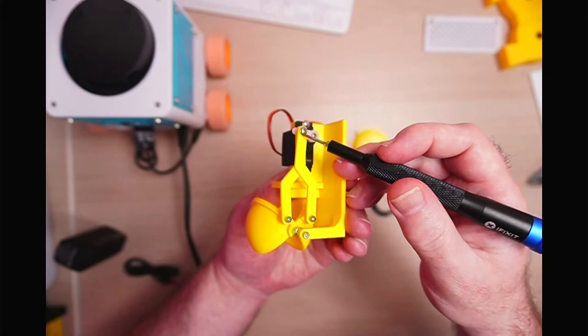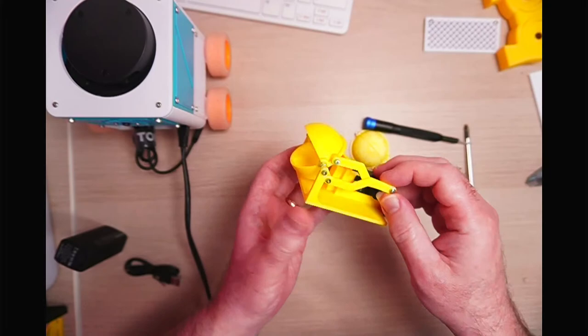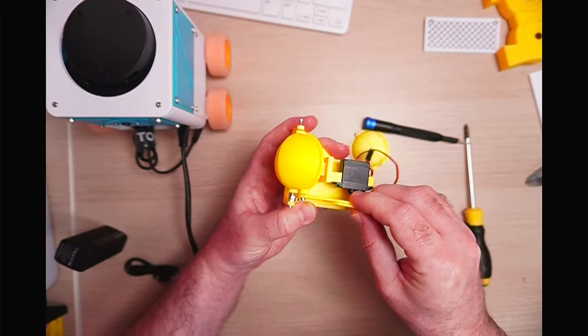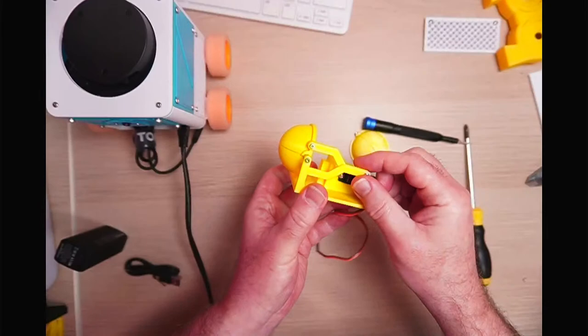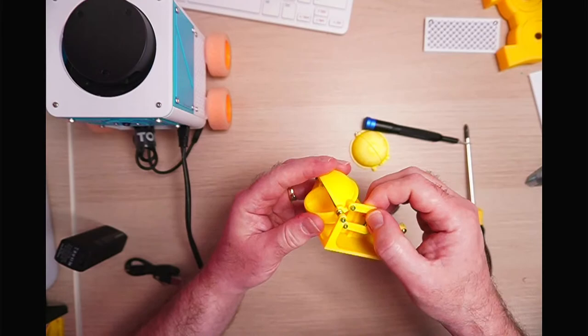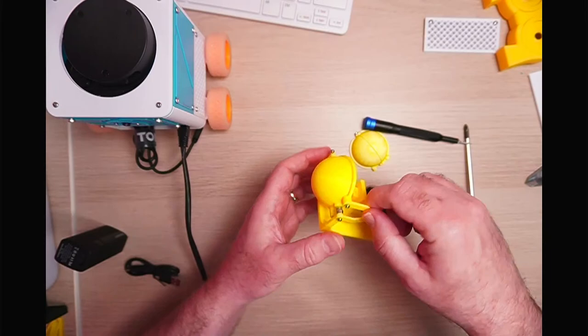And then on the front here, I've not quite got the distance between this profile and the center just right. Now at the moment on this physical one I've got here, there's a bit of play. So you can see there, if I go overhead like so, that's got a bit of play there. That's not quite how I want it to be, so I'm just going to have to re-engineer that slightly. So it does work in that direction. If I hold it back and I pull the servo, it will open. And probably what I need to do is move these, instead of being 10 from the center, maybe about 15, something like that, so they've got a bit more leverage to go back. And it just means extending these about. So we just need to play around with these settings a little bit.